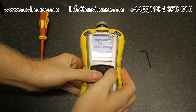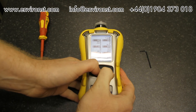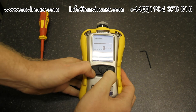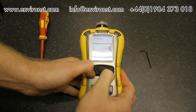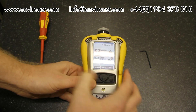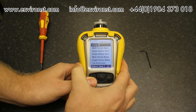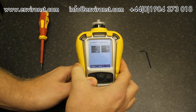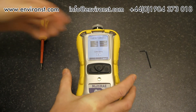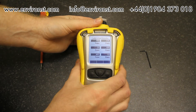With the unit reassembled and needing calibration, press and hold power to boot up and drop into the calibration menu. Select calibration and perform a fresh air zero — assume we're outside for this. The zero calibration finishes and scrolling through confirms everything has passed.